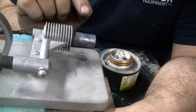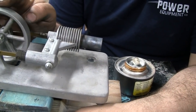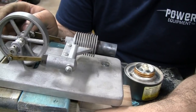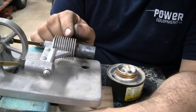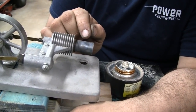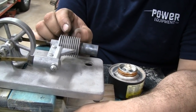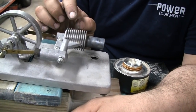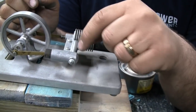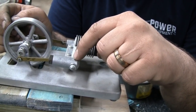How these work is you heat this end and you spin the engine to get the cycle going. What happens is the displacer piston — when that moves forward, it literally does what the name implies: it's a displacer. So that moves from this area where the fins are up into this area, and it occupies the space that the air within here would have occupied. That air gets pushed back to the area where the fins are, then it cools and contracts. There's a crossover port through here, and when the air contracts, a vacuum is formed and it pulls the power piston up into the cylinder.